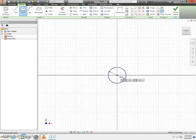Next, zoom out just a little bit and take the line tool. Start from the origin and make sure you have your vertical snap. We want this line to go vertical 1.625 — that's 1 and 5 eighths of an inch. Make sure you have your straightness snap and press Enter on the keyboard. Press the Escape key.